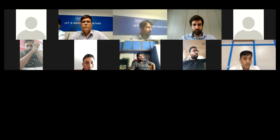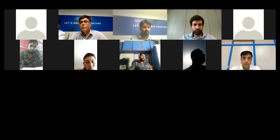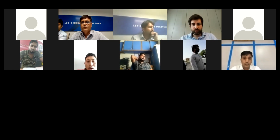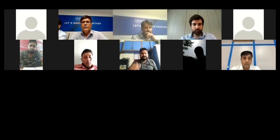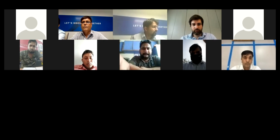Okay, I can reply, and then maybe Pratik can add some more comment. Well, the cleaning interval can be scheduled automatically according to line condition. So if the line conditions are ideal, usually we run, let's say, 4 hours without any need of cleaning. And the Decora machine with Kyocera printhead is not having purging. So the cleaning is just a suction, automatic suction with the cleaning cart, but you don't need to purge, so you don't waste any ink.